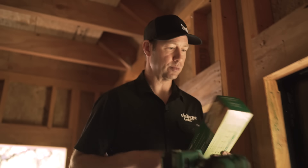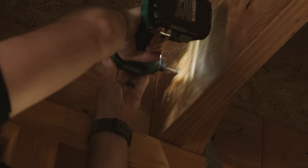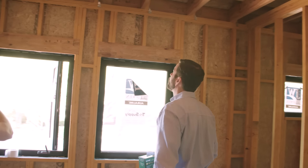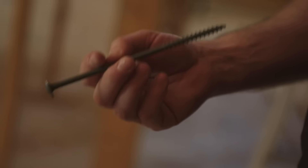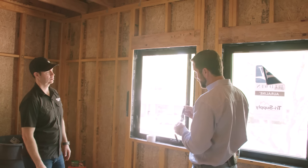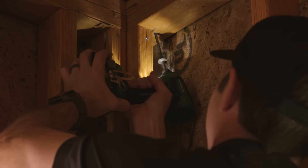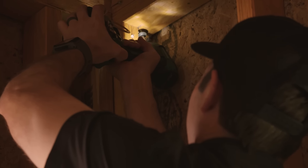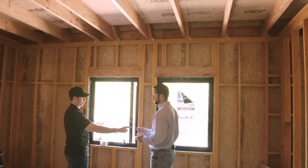There's a relatively new product line from several manufacturers - a replacement for a lag screw. Here we have SPAX power lags. These have similar values to lag screws but are a smaller diameter, don't require pre-drilling, and are easily installed with an impact driver. We're using them as a truss screw - they're designed as a replacement for a traditional hurricane tie. They're more discreet, don't protrude and conflict with drywall installation, and install faster. We're going through the double top plate into the rafter with a long power lag, and a shorter power lag connecting the ceiling joist to the rafter.